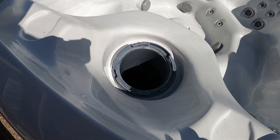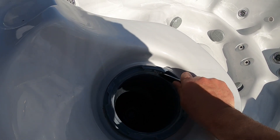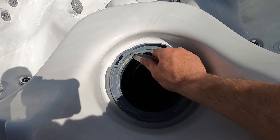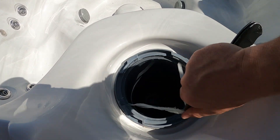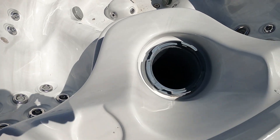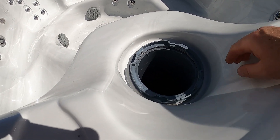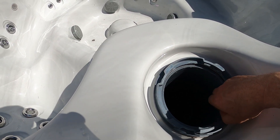The issue with this one was that the filter bucket had developed a crack. I was able to kind of temporarily fix it with some silicone. I always hate talking bad about any sort of hot tub brand, so take this with a grain of salt. This is a common issue unfortunately — I have replaced probably five of these filter buckets, so when I've done that many I kind of say it's a common issue. I can only imagine it's because of expansion and contracting that this filter bucket developed this crack right along here on the brim, and so it was leaking through there pretty good.